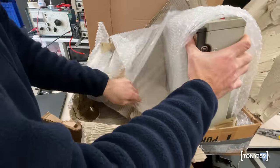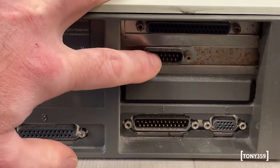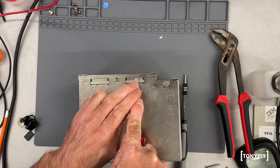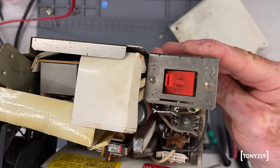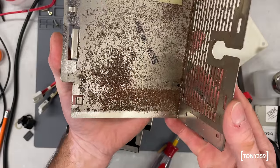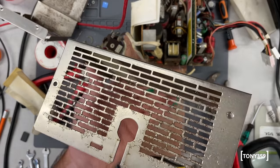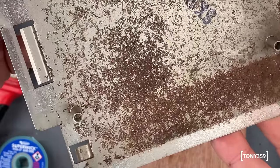I got this PS2 about 12 months ago and I've been putting it off indefinitely because I knew that restoring the metal parts would be a royal pain — and I was not mistaken. I was hoping I could just brush some rust off and keep the original chrome finish, but it turned out to be more difficult than that. Let's begin with the power supply. As you can see it's in rough shape — rust everywhere — and the whole power supply is a jigsaw to disassemble. Mains cables need to be desoldered and the mains switch is riveted to the frame. The metal case and PCB have also seen better days.